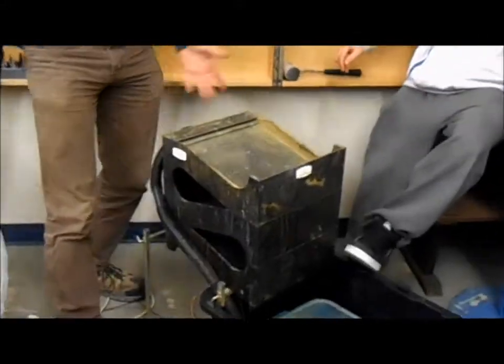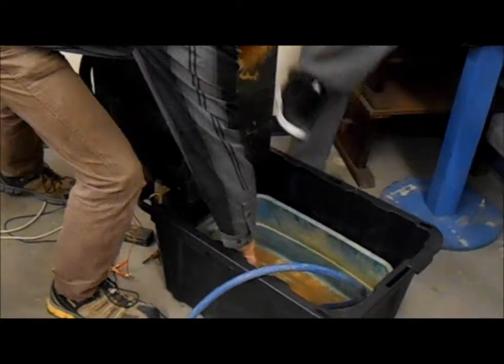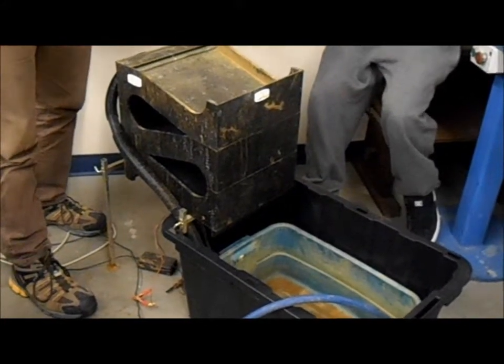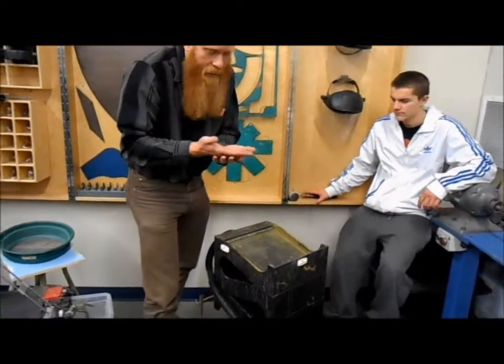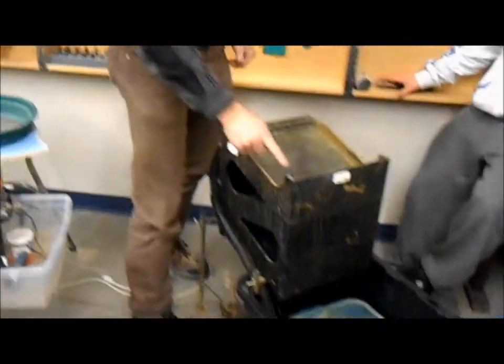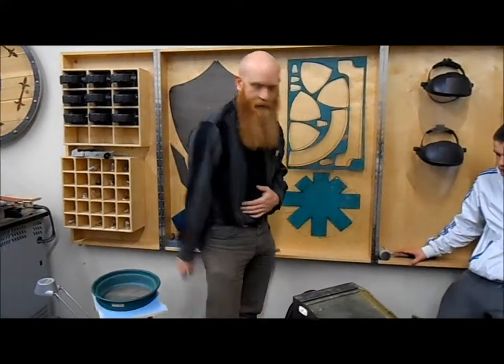With the gold cube, the water pump is on the end of a hose in the big bin. The smaller inner bin catches all the tailings and discharge sand. The water separates from the sand and rises to the surface. I've even sloped the inner bin so water spills off the backside toward the pump. Any silt that escapes the first bin should settle out before the water gets picked up and cycled back through.